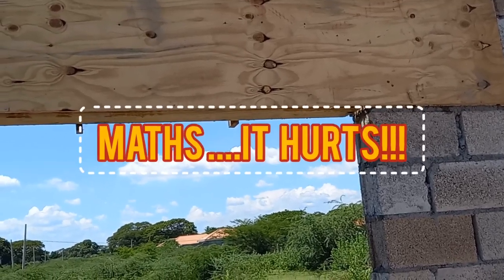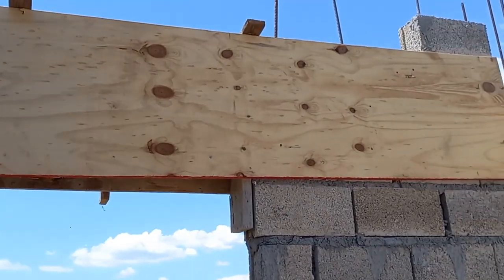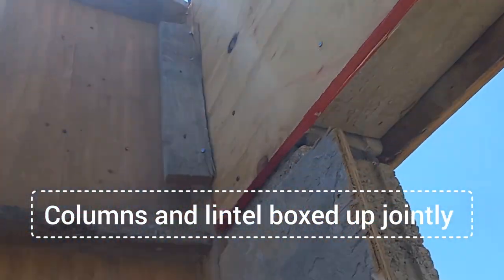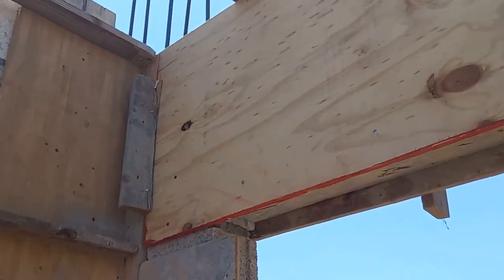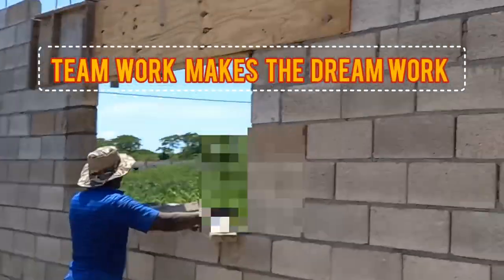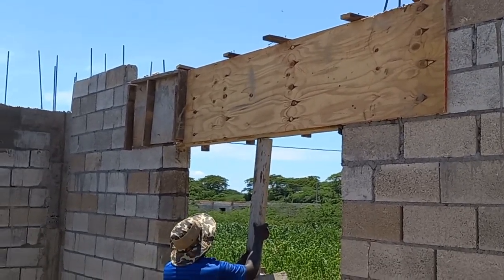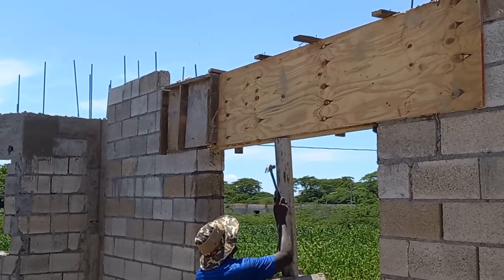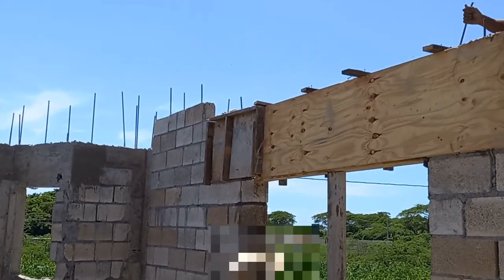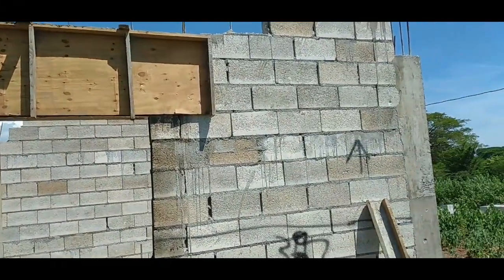The ply form goes at least the length of one and a half blocks, because the width of the lintel should match the depth and thickness of the opening, which is somewhere between a range of one-twelfth and one-eighth of the span. You may have noticed some incomplete columns all around this section of the house — fret not, the builder has it locked. Here you see a lintel being jointly completed with a column, because one cannot survive without the other. Teamwork makes the dream work — the builder and his second have that down pat.